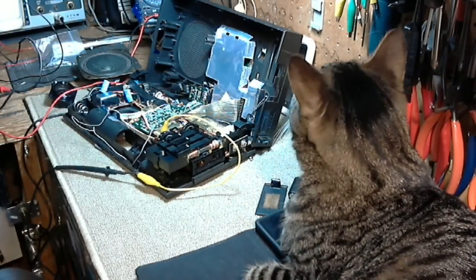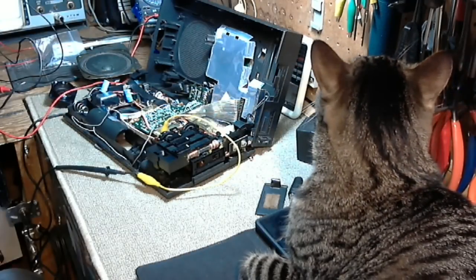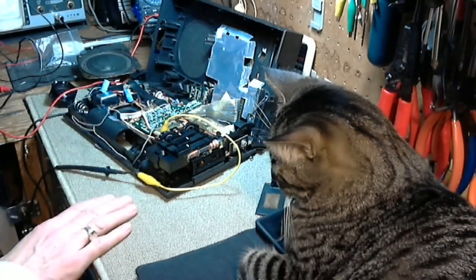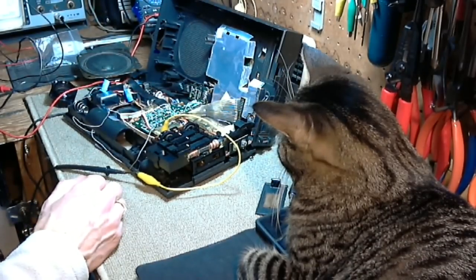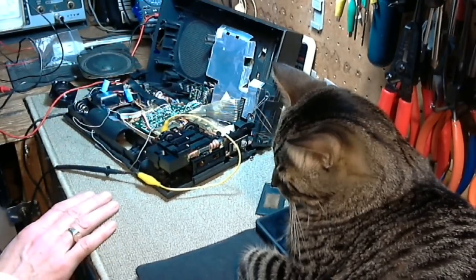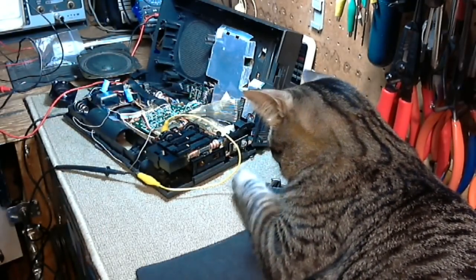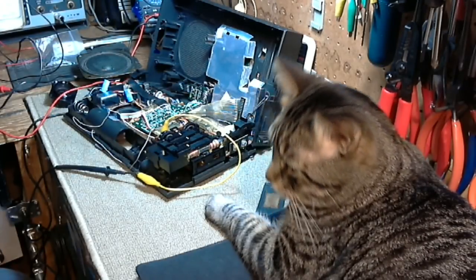I have the feeling there's nothing wrong with this radio at all. What was originally wrong, if you remember way back, battery connections. Typical of this particular model, battery connections no good. I put in the wires here to work around the bad, unreliable battery connections. Maybe that's all that was wrong. And the rest of the time, I've been hunting for problems of my own making. I hate to suggest that, but I shouldn't say these things until we do a little more here.